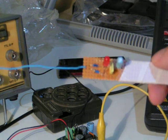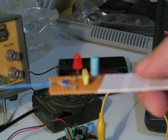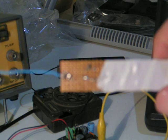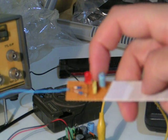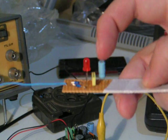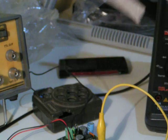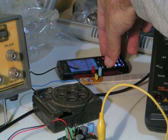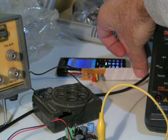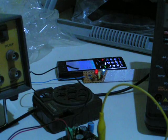Sorry for the position of the camera, but I tried to keep it away from the mobile phone because I get some noise from it. This is the wire — the antenna — we have the two diodes here, the LED, the 100nF capacitor, and this is the electrolytic capacitor which will be used to provide AC coupling. Let's place it next to the mobile phone and make a call. I'm going to switch off the light so it's more visible.